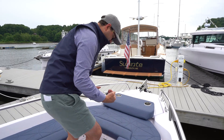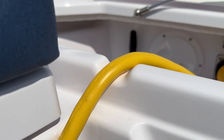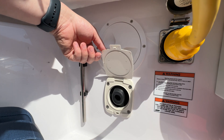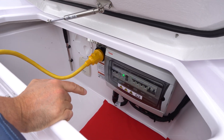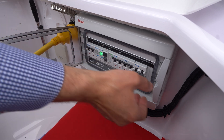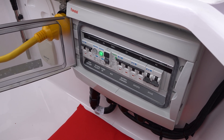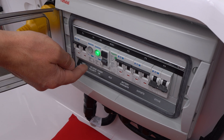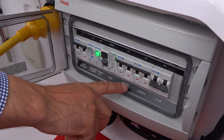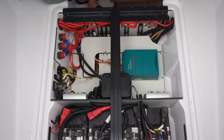Moving one step aft, there's a simple machinery space that incorporates some electrical components. Notice how there's a little notch cut out for the cord so when you are plugged in you can shut this hatch nice and easily. Forward here you've got a manual bilge pump and the handle associated with the bilge pump, and then your electrical breakers. This is all associated with the 110 shore power outlets. Opening that, you can see these two clips on the side. Everything is presented clearly on this panel — you have your main breaker, and with the green light here that's telling us we do have power coming in. We also have your battery chargers and outlets on. I'll show you exactly where the battery charger is located on the boat later on in this video.